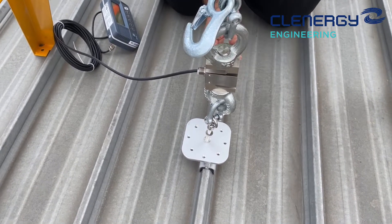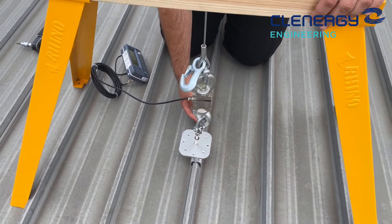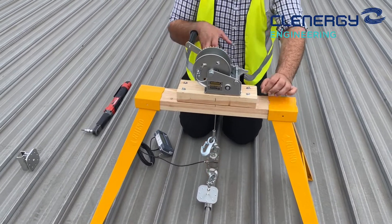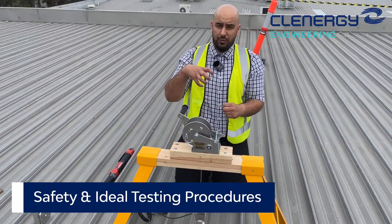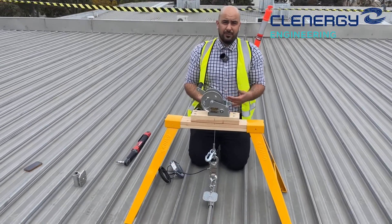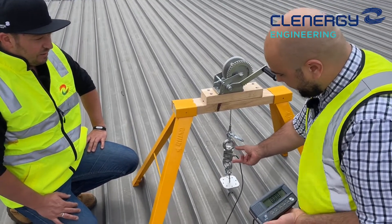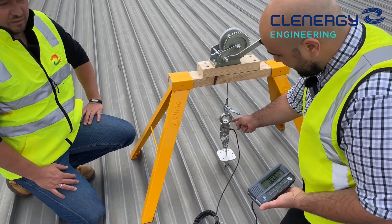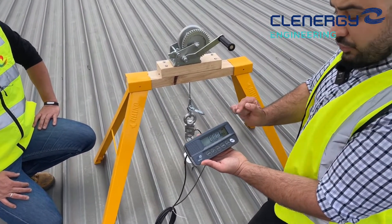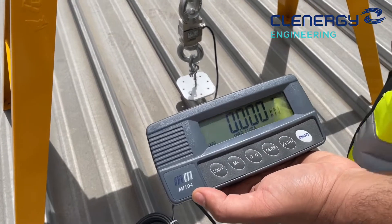You can see it's pretty much central through the center of the whole thing, so we're testing directly straight up against the internal clip of the clamp to the roof sheeting. The two things we're looking for are whether the clamp itself disengages from the clip lock roof sheeting, or where the internal roof sheeting clip disengages from the roof structure itself. This load cell effectively tests the pull force — a magnet in the center gives the reader a reading of how many kilonewtons of force is being applied to the system.